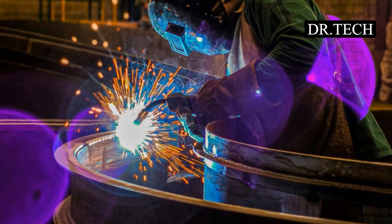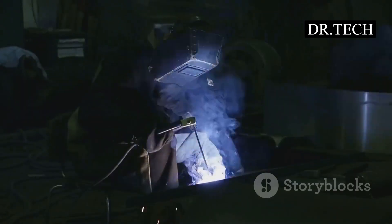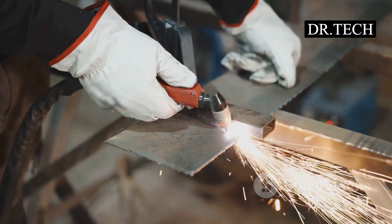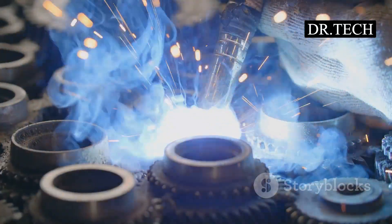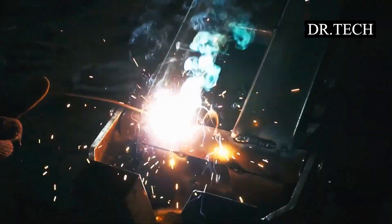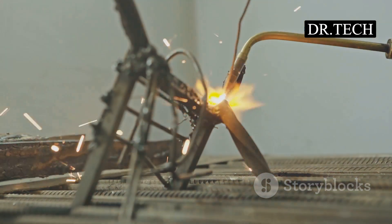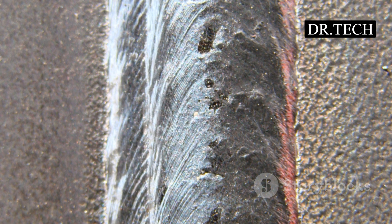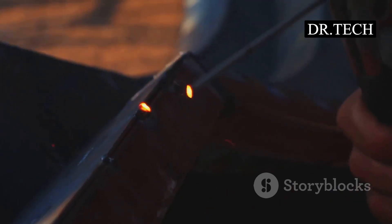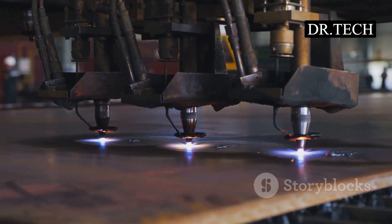This pressure ensures the two metal pieces are in tight contact — good contact lets electricity flow easily and helps forge the metal together when it gets hot. Then, for a very short time — fractions of a second — a huge amount of electrical current flows through the electrodes and into the metal. The metal resists this flow, creating intense heat right at that spot. The metal melts, forming a small pool of molten metal — the weld nugget. You might see a quick bright flash and maybe a few sparks. The electricity stops, but the electrodes keep squeezing while the nugget cools and solidifies, joining the two sheets. Then the arms release — and there you have it: a spot weld. Position, squeeze, zap, hold, release.